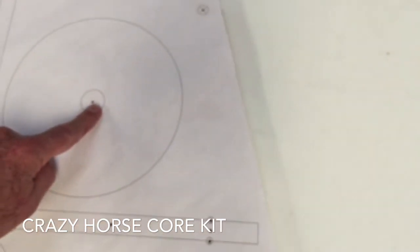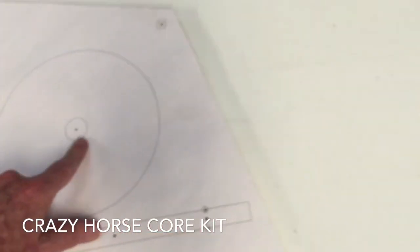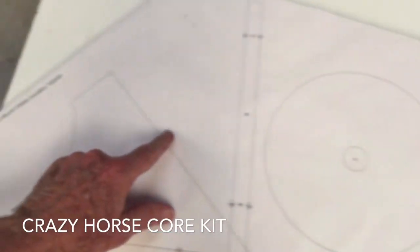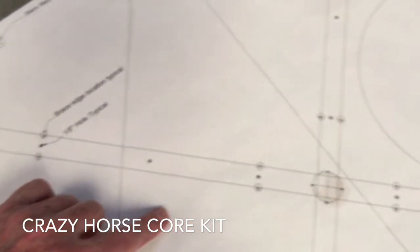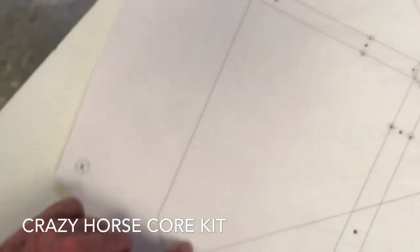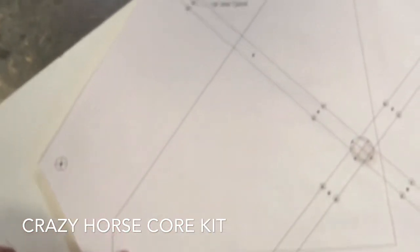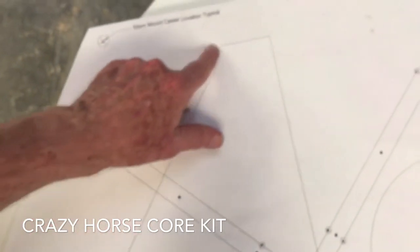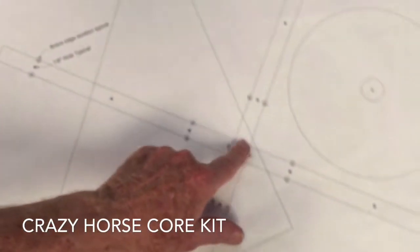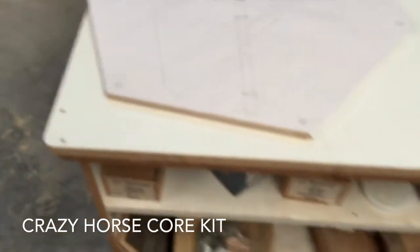On the pattern you also have a full-size collar pattern. That center hole would be about an inch and an eighth — that's going to be fairly accessible for an inch-and-an-eighth drill. It's actually 1.05 but you're just not going to find that. The triangle that you see here on the pattern is also full-size — you just need to cut it out. You'll need four of those, and there's a special edge on that long edge that we'll look at a little later.